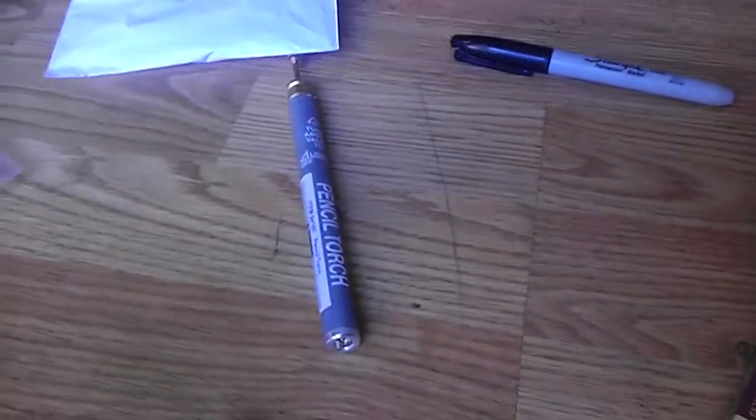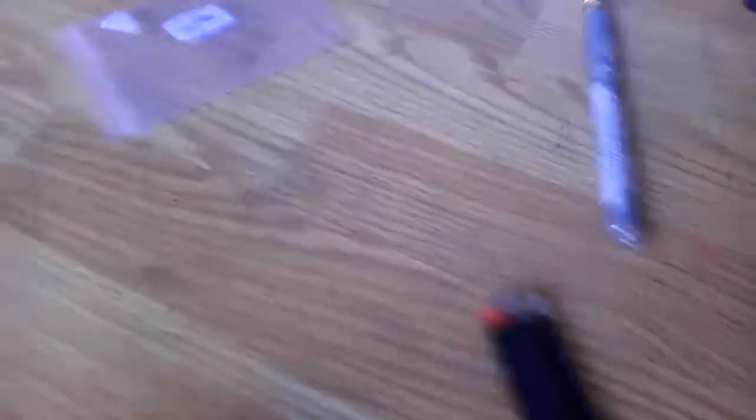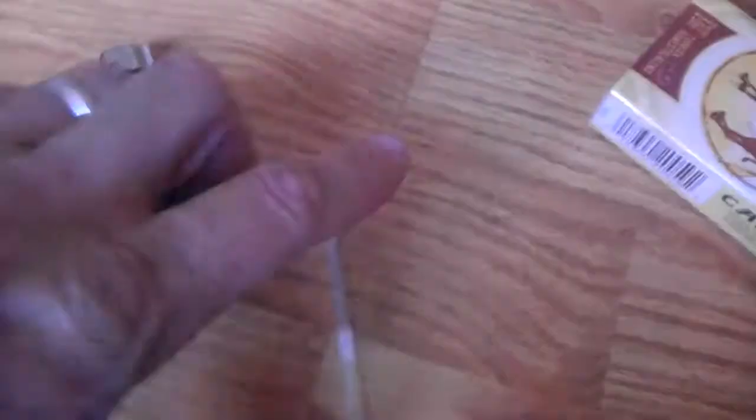Basic tools: drill, drill bits. I got a piece of wood so when I was drilling my hole in a piece of acrylic, I wouldn't go into my floor. How I made the bend — it's a little black, I've got to wash it off. I just used a lighter and went back and forth real quick on it, started pushing it down. When it started to go, I did it a little bit longer, bent it down into the 90 degree, then dunked it in the water and held it in there for a minute, and that made it solid. This is actually a little piece of acrylic from when I did my sump that I saved.